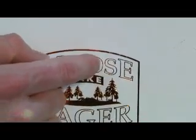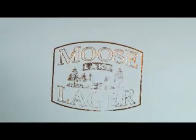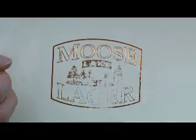What we're going to look at is an area up here on this label, which needs some spot, and then you have some major areas that need some spot make-ready down here. So I'm going to show you today how to build up in just those specific areas to produce a good foil stamp, where you're getting proper coverage across the entire web with both images.